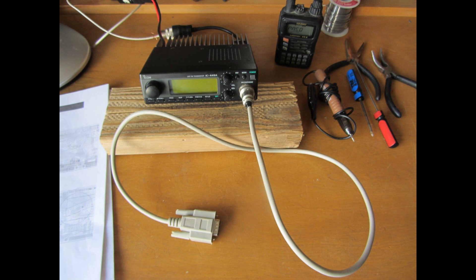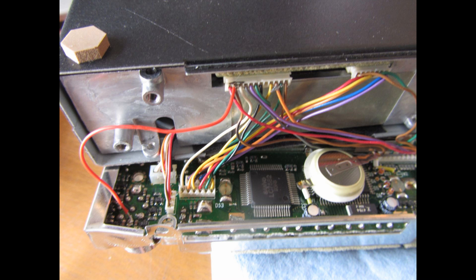The 440 half-duplex radio serves as a link to another remote base. This was intended to be a plug-and-play move of the radio into the new configuration, but Mr. Murphy had other ideas. The RCOM controller wanted nothing to do with the existing COS signal, which caused the radio's automatic shutdown circuitry to keep the squelch closed. About two days of troubleshooting were consumed to overcome this issue.